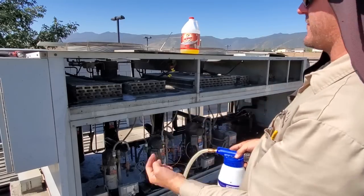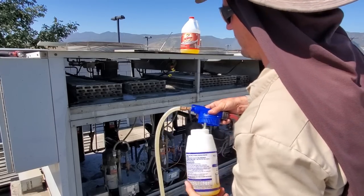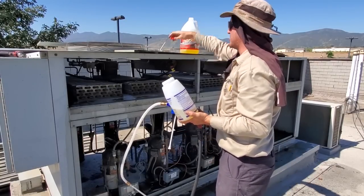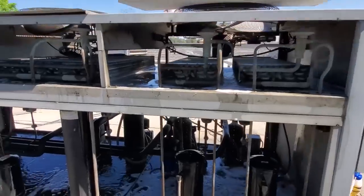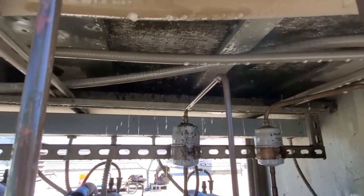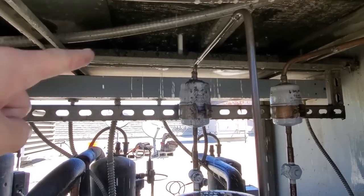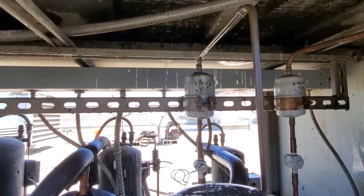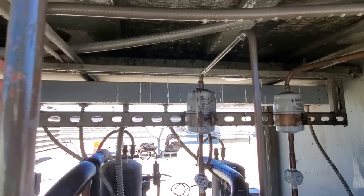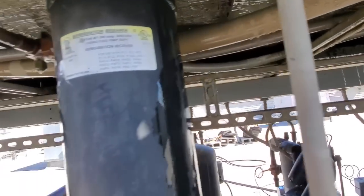Even though I'm rinsing from the top down, I'm pushing the dirt out the opposite — the right way — basically the opposite way of airflow. I'm also going to spray the cleaner on the bottom side too, just to help penetrate some areas where I may not have gotten. See up in here — it's really caked in there. The way this rack is designed, there's a drain pan right here to keep the water from falling on the compressors. That drain pan is full of mud and everything that I'm washing off is getting stuck in it. So when you're done, you've got to put your hand in there and pull all the big chunks out, or when it dries up it's just going to suck right back up onto the condenser.